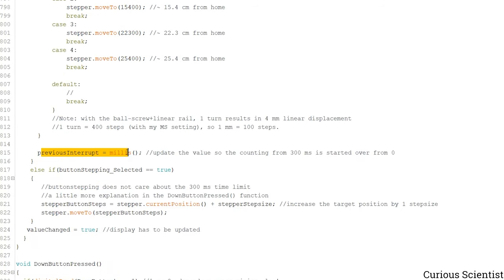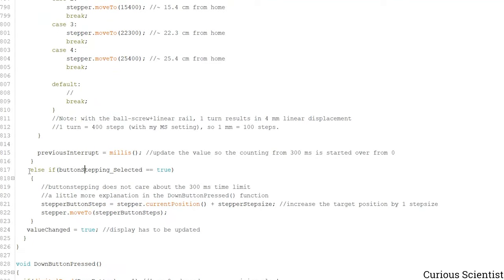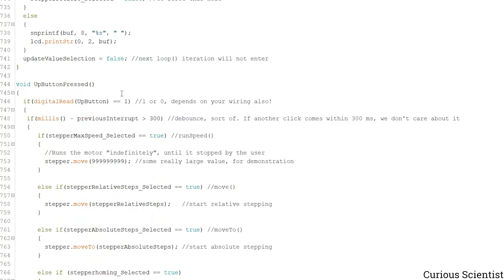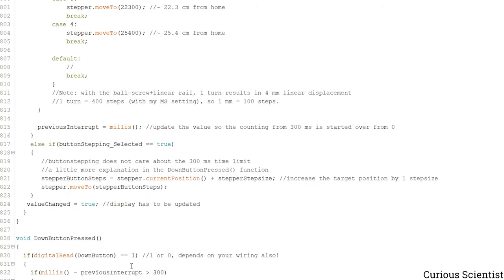And then we just update the time, and we exit this branch of the if conditions or else if conditions. And then if we selected the button stepping, then what we do here is that we start to move with the buttons. And that is not checking this condition, because we are outside this if. So this allows us to keep the button continuously pressed, and then the stepper motor will move according to the button